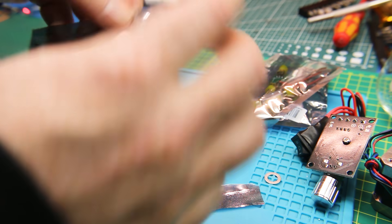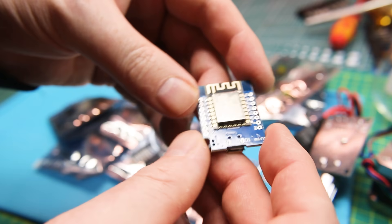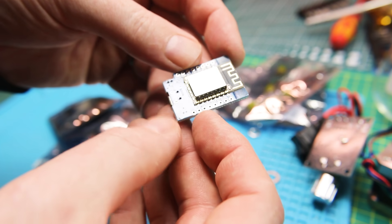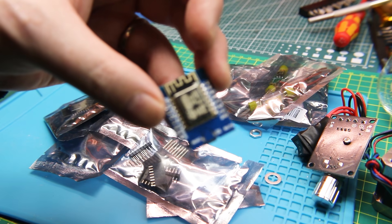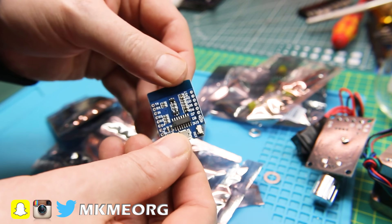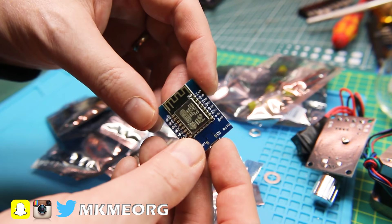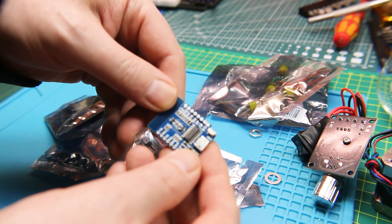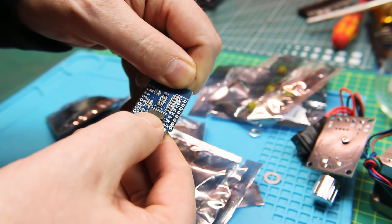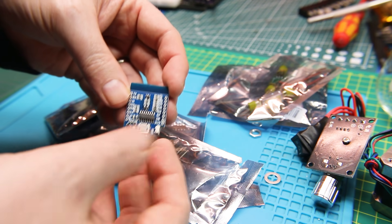A whole bunch of nifty little electronics packages — these look to be ESP8266s. I have a lot of them already but we got more. This is the WeMos D1 Mini — not the D1 Mini Pro, it doesn't have the external antenna, which I actually have an upcoming video on. This is just the standard D1 Mini: a wonderful little ESP8266-based microcontroller, 3.3-volt logic level, a little bit of IO, USB-powered with a voltage regulator on board and USB-to-serial — that's a CH340G on there. Wonderful chipset.